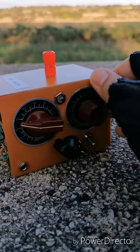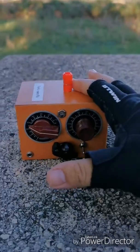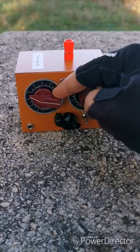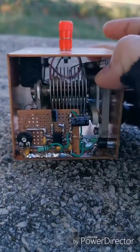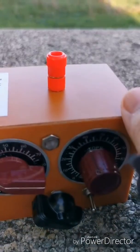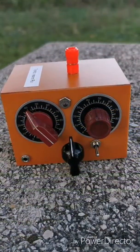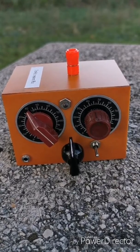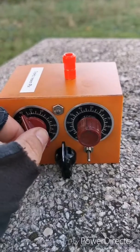So those are my modifications, and they work very well for me. This receiver is built for 7 MHz, but I found that with my variable capacitor it works from 6 to 13 MHz. You can receive CW, AM, and SSB signals.